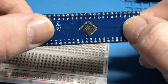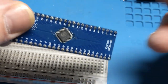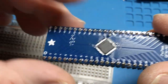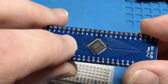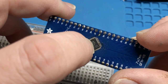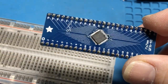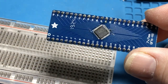And you know, I might have said before, I really don't know how I'm gonna test all these connections for sure. If I touch the pad and the pin with the continuity meter, then I get a beep. The pad and the pin are very clearly connected with this trace, but I have no surefire way other than plugging it in and trying to make all the pins output something to be sure that these pins are all actually connected on the chip.